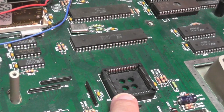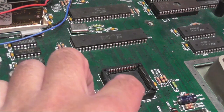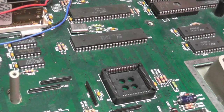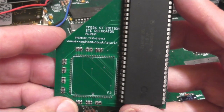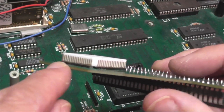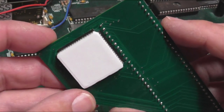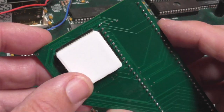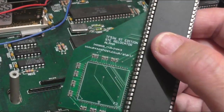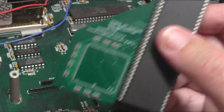You've got a socket like that and it takes a little bit of cunning to come up with a way of getting something into there that resembles a PLCC68 chip. The way this XOS Alpha board does it is that it has a series of 1.27mm pins soldered in and a big 3D printed backing plate to hold them at the appropriate distance. This particular adapter also has pull-up resistors around here to help stabilize the bus.